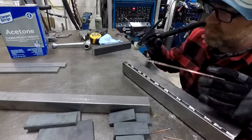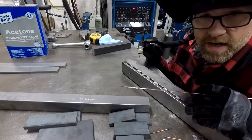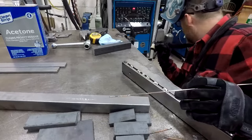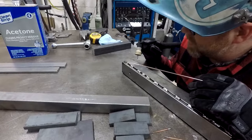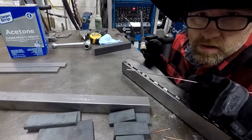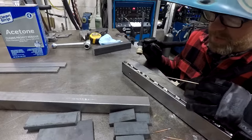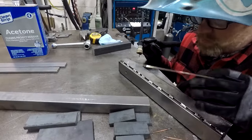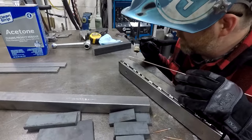We're using pulse on this to also try and control the heat. We're welding at 190 amps, right about 30% background. What's happening is we're probably not even quite getting to 190 — probably 160 — and then it's backing down. That helps keep the heat out of it, plus moving, plus pausing and waiting and letting everything heat soak. It really does help with the warp.